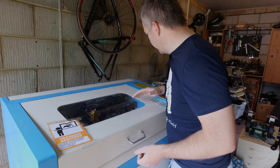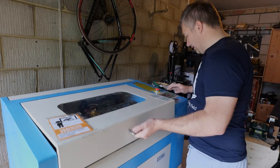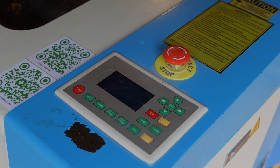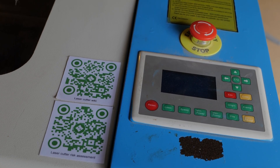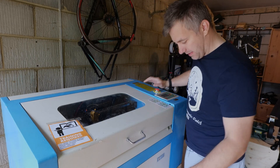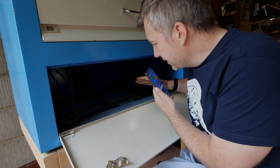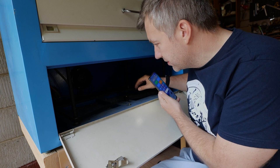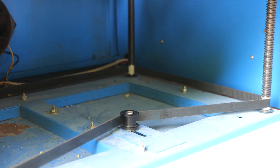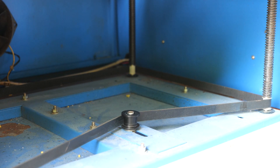The glass is a safety glass, but it's still recommended to use safety specs — you only have two eyes and you want to keep both for stereo vision. There's a small panel to manually operate the laser, which I need to verify is working. There's an emergency stop in case anything goes wrong. Opening the bottom compartment reveals the belt system that synchronizes all four pillars keeping the bed level — there's plenty of space to hook up a motor in there.